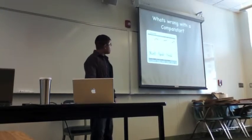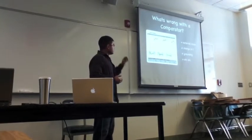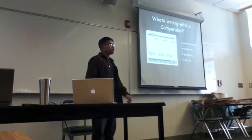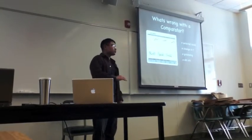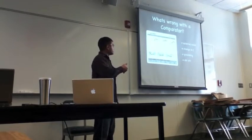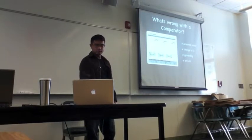But why can't you use a comparator? Because it's not a consistent output. And that's the main reason why you can't use a comparator. It ranges, it goes high and it goes low. And then once you get noise, there's spikes, there's signal spikes inside your output. And because of those spikes, you'll mess up your comparator outputs.